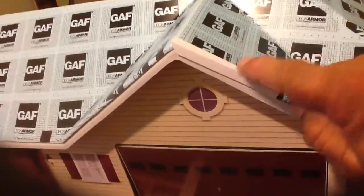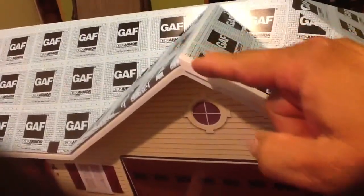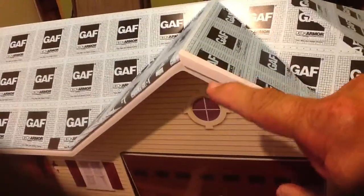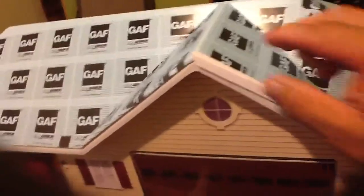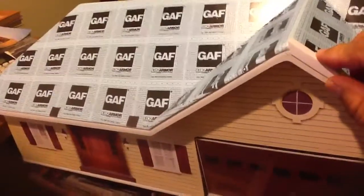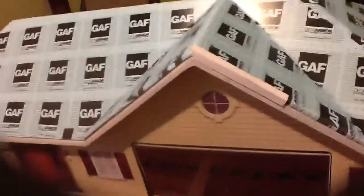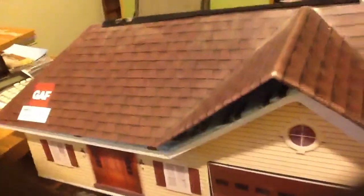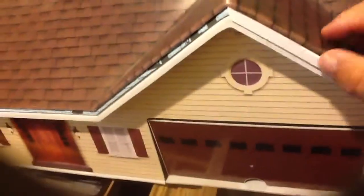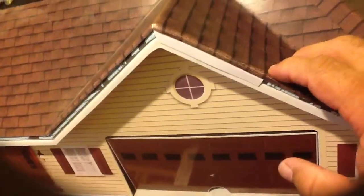If water goes that way, it's onto the deck and it works its way down. The shingles cover this, and drip edge comes down on the barge rafter right here and down off the roof, not having that exposed like the picture that you sent me. Once that's installed around the perimeters, ba-bam, within a few seconds you have about 20 squares of shingles installed. Well, that's a pretty quick roofer, huh? Fastest roofer in town.